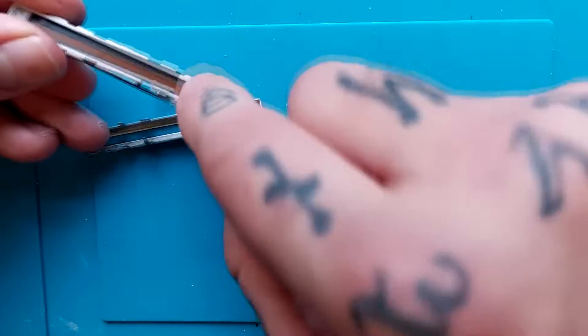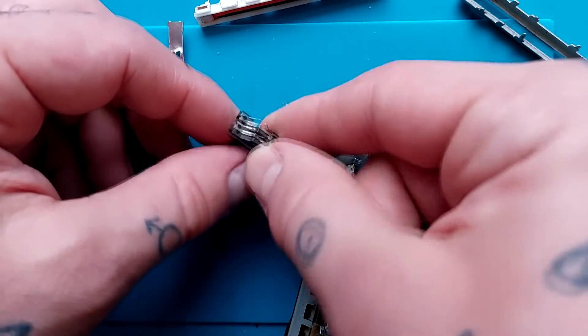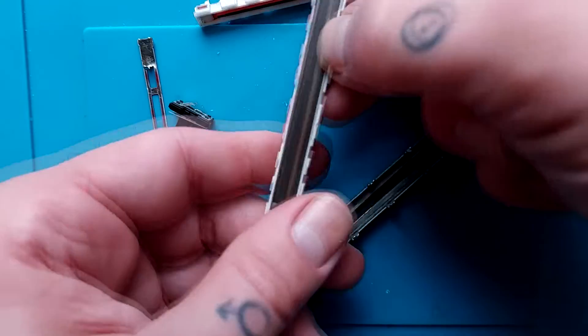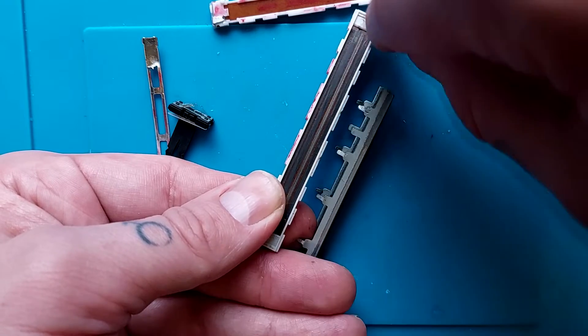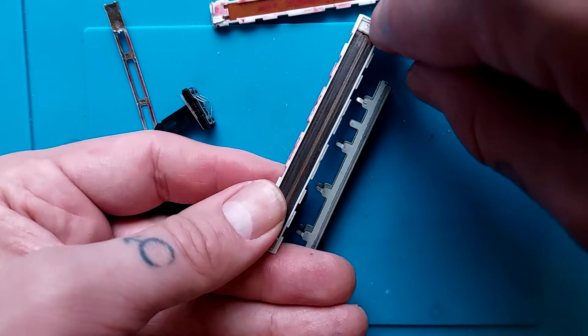The pins come around the plastic and touch this plate, which will be sat underneath the conductive plate. It's only these little surfaces that are conductive — the silver ones I'm pointing to here. This is a stereo slider. What these brushes do is create a bridge between one area which varies in its resistance along its length and another area which has very little resistance.